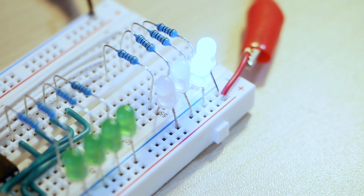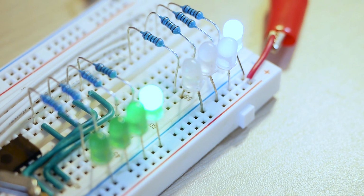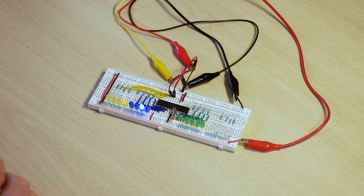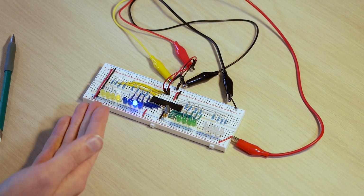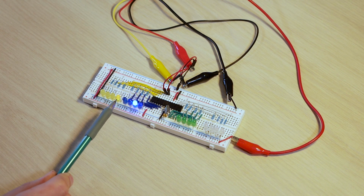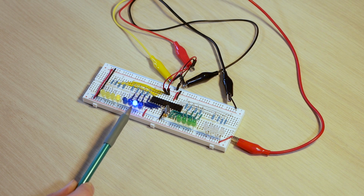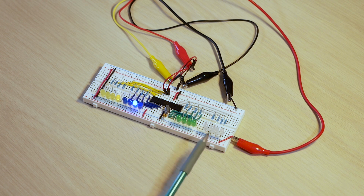So the way I have prototyped this clock is to display each 4-bit binary number in its own color, so we can read 4 different digits: the 2 hour digits and the 2 minute digits. When I program the microcontroller to turn on, it will initially display 12 o'clock, as most clock radios do when you turn them on. As you can see here, our first hour in amber is a 1 in binary, and our second hour, or least significant hour I should say, is displaying a 2. So we have 1, 2, or 12. So 12 something, and in this case it's 00, so 12 o'clock.